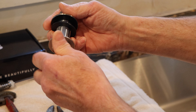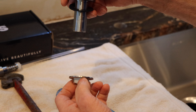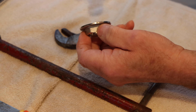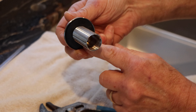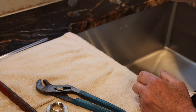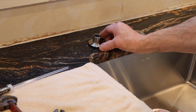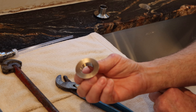All right, so now we're going to take this nut back off. We're going to go underneath the bottom, screw it on as tight as we can by hand, and then we'll use our wrench to tighten it up. Now I just want to point out that when you put this on here you do not need to use any sealant underneath here — this is a rubber seal that seals perfectly. So we're going to take this, put it down through here, center it in the hole approximately, and then go underneath and screw the nut on as tight as we can by hand.